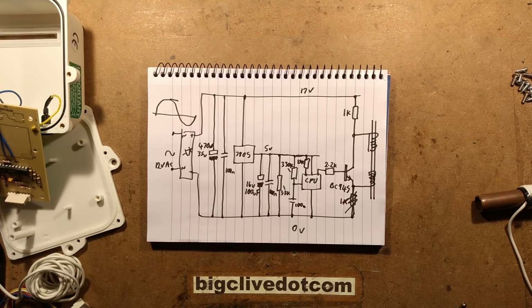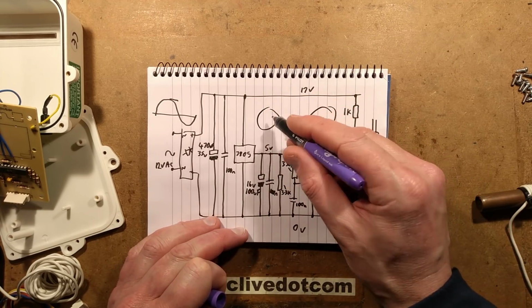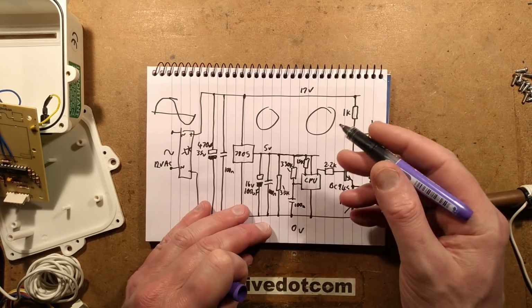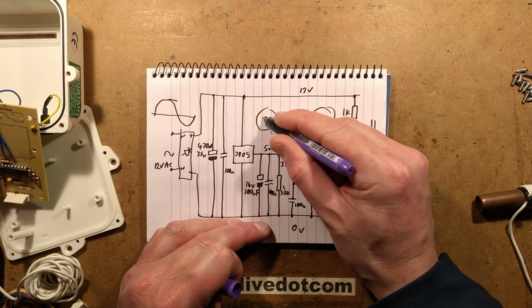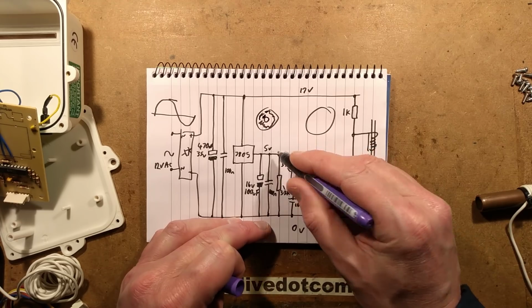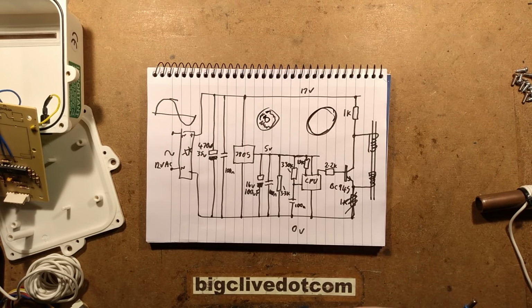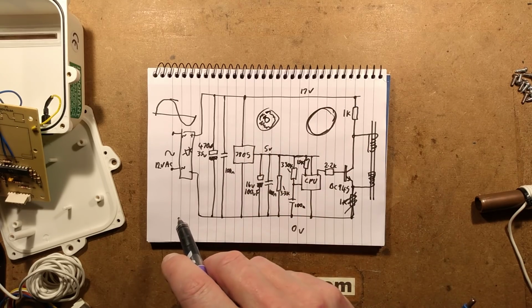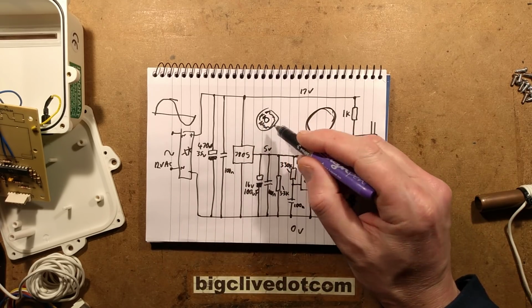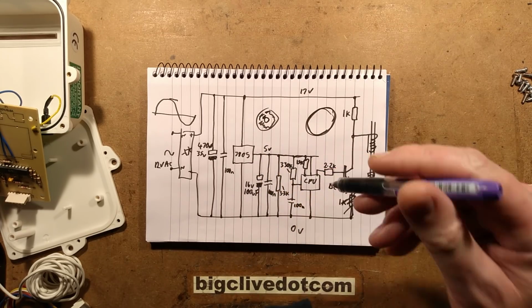it's real. But the only way you could prove that, and this is what these things tend to rely on, is to actually put it in a house and then saw the pipe in half and see if it had furred up. I remember when these things first came out, and they use the same pictures for the magnetic water softeners. They show a worst example of pipe that they've cored through, and then all the crust, and then they say before and after, and it's a lovely clean coppery piece of pipe with no contamination. So that's what you'd expect to see if it did work, and you had an installation of this running for many decades, long enough to actually fur a pipe up. You'd expect to see this on one side and lovely clean pipe on the other, if it worked.